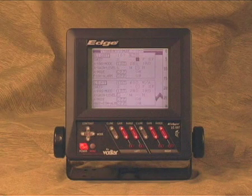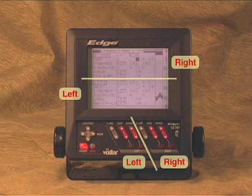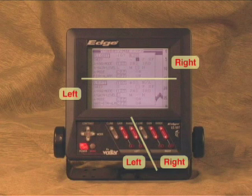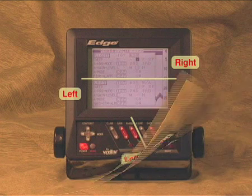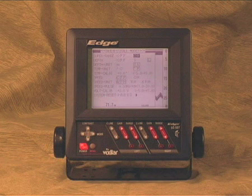Press the menu key again to change to the second menu screen — pressing any other key will exit the menu. This menu determines how each of the two sonar units will function. From here you can set the sonar frequency, sweep speed, how the outer range functions, the general level of the auto gain feature, and whether you want an A-mode or instant view bottom display. You can also turn the fish or hard bottom alarms on or off. Use the up/down keys to scroll to each feature and left/right keys to change the setting, then press the menu key to advance to the third menu.